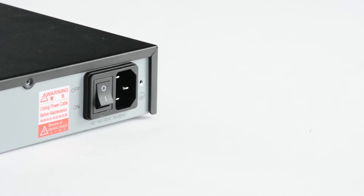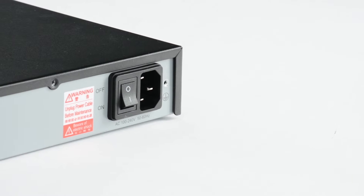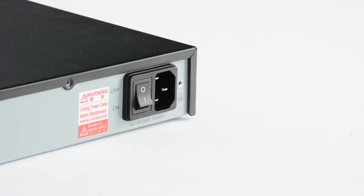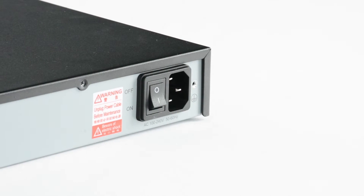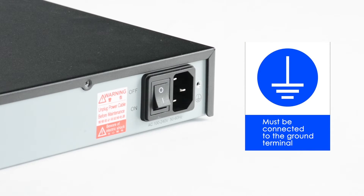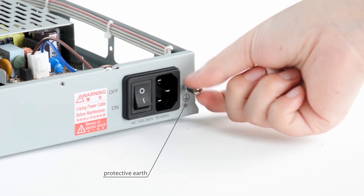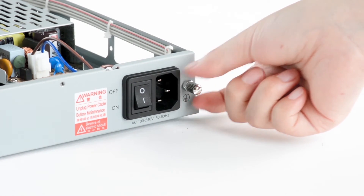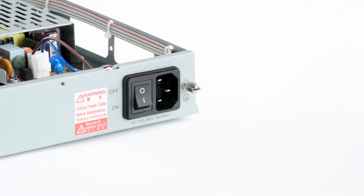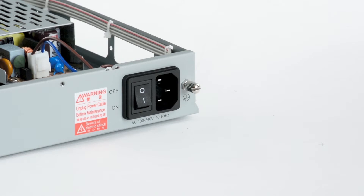Next, connect the ground. Attention: proper grounding is very important to reduce the risk of electric shock and to protect the PBX from the bad effects of external noise in case of a lightning strike. A permanent connection between ground and the ground terminal of the PBX must be built. Tighten the provided screw stud to the port. Connect an 18 AWG grounding wire, tighten the screw nut, and attach the grounding wire to the grounding terminal. Please note that the grounding wire as well as the grounding terminal need to be prepared by yourself; Yeastar won't provide them.